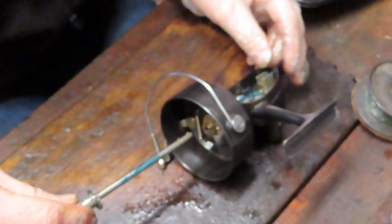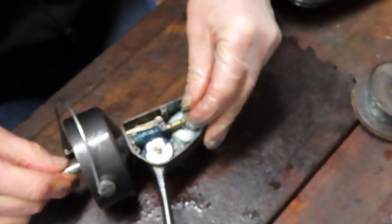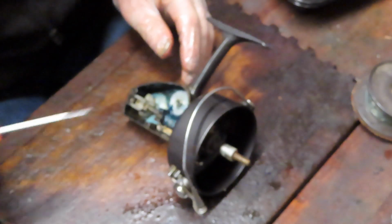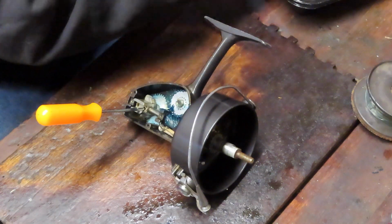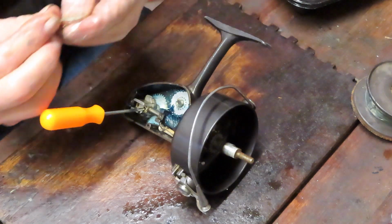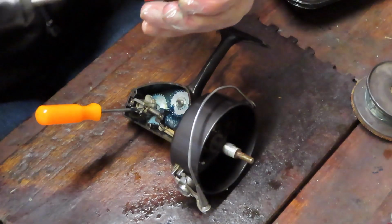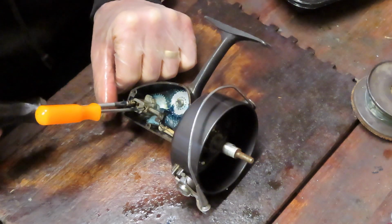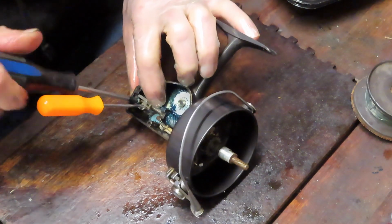Line up your holes so that they're coming down straight through like this, so you can see where your holes go in terms of the alignment with the screws. In this case, I'm in pretty good condition here because I have 2 holes, so I can use a pick to hold the one. Going to grab that other little washer, put it onto the screw. See if I can't get this to hold this way. Doesn't seem like it. I'm going to use a little bit of glue, which is the grease that I use. And now we should be able to get that screw started.